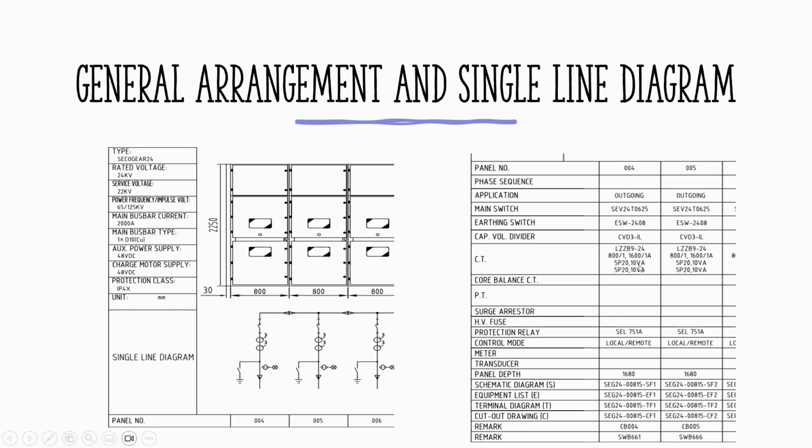Burden means whatever connected to the CT, all the resistance, cable, test block, CT link, going to the coil of your relay, that is the burden. It means that the burden is the capacity of the CT to push the current. If you see some remote protection coming from transformer remotely going to the board, sometimes the VA is big because it considers the voltage drop to push the current without a drop.